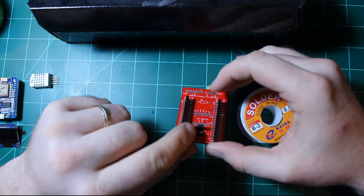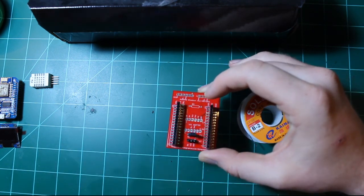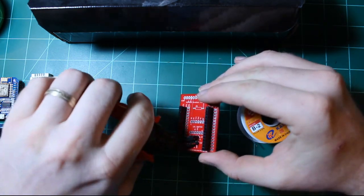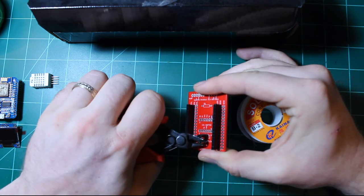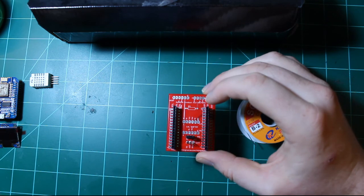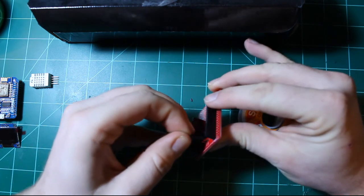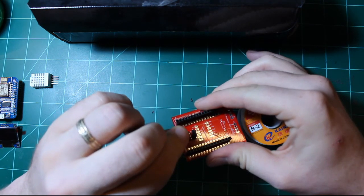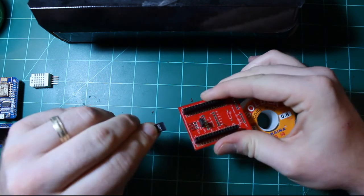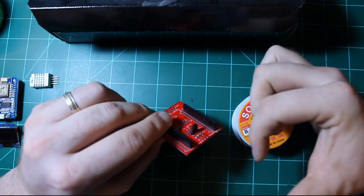Next, we will want to bend the sensor connector over to the side so it sticks out of the enclosure. But first, I prefer removing the plastic from the header pins, so I'll grab it with my cutters and just slide it off. And there it is. For bending the headers over, best thing to do is take a servo connector, slide it on fully, and then slowly bend it over all the way to the bottom. Slide it off, and we have the 3-pin EXT connector header pins pointed outside of the enclosure.